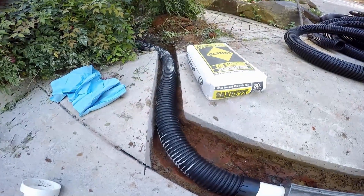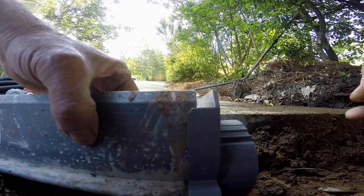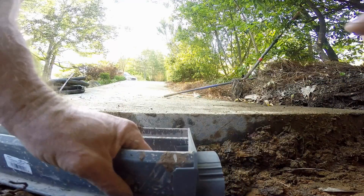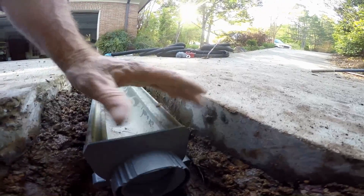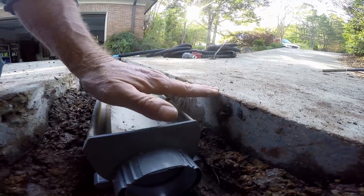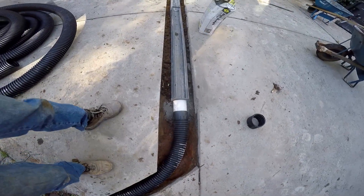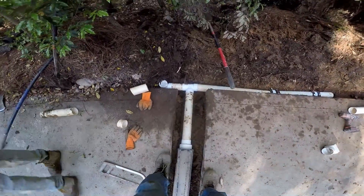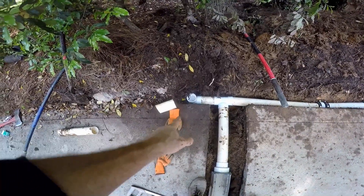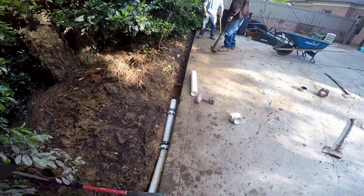You can see our four inches is underneath the concrete there a little bit, which is fine. Then we'll go ahead and set the channel drain and continue it on down. Now we're putting the adapter on the discharge side — it just slides in, tap it in place, and make sure it's down there really good and secure. We're actually going to raise it up so that it's just ever so slightly below the grade of the concrete. So we've got everything hooked up. You can see we've got our channel drain squared up in the center of the trench. It comes down and we switch to PVC out here. We're going to add a little drain right over here just because there's a low spot in the concrete — make sure that gets picked up.